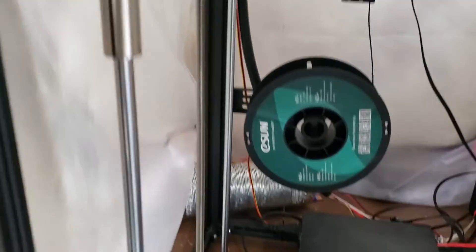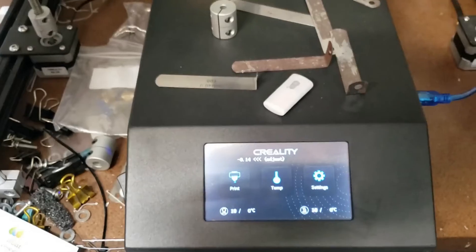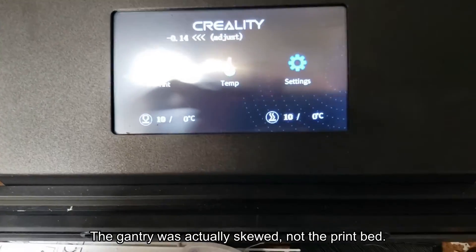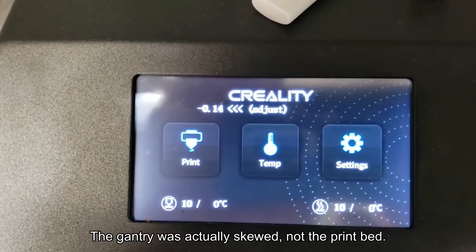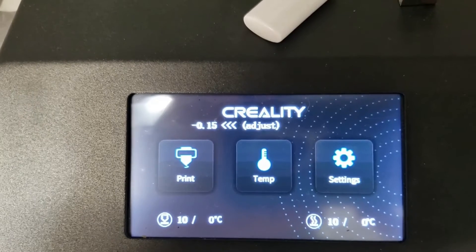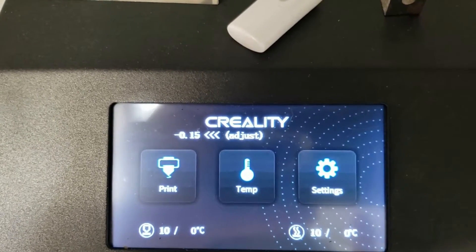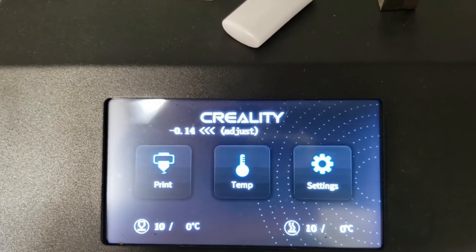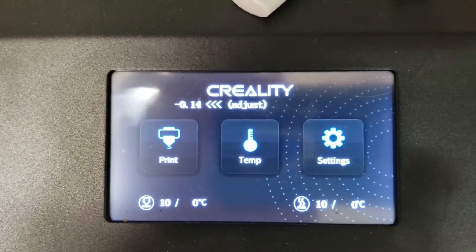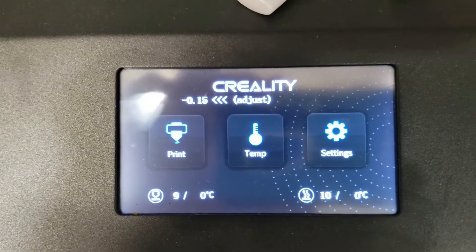Let's see what's going on here, because I made some major adjustments to my printer — I noticed that my bed was actually skewed quite a bit. On my Tiny Machine's firmware, you can see at the top that it's telling me how far off my level is. I have the tolerance set to around .02 millimeters, maybe .01 — I can't remember. You can customize it in OctoPrint in the plugin settings.